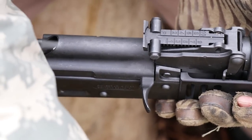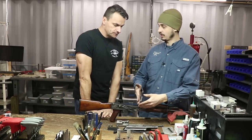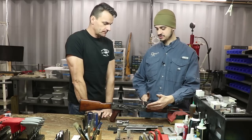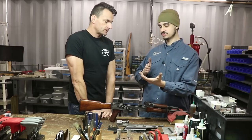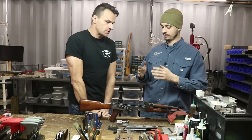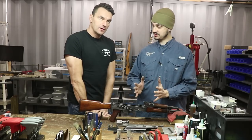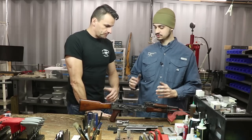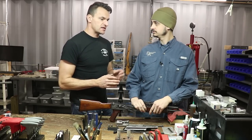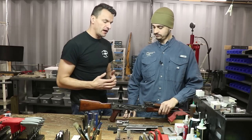It could be many reasons. As we test American AKs, we look at the metallurgy — we see crumbling trunnions and so on. Sometimes you could have perfectly inspected parts, but somebody used a once-used barrel, and if the original slot for the barrel pin has a little gap, the barrel could be walking forward. Your metallurgy could be fine. It's just a sign that progressively something is coming apart and you're heading towards danger — that's the bottom line.